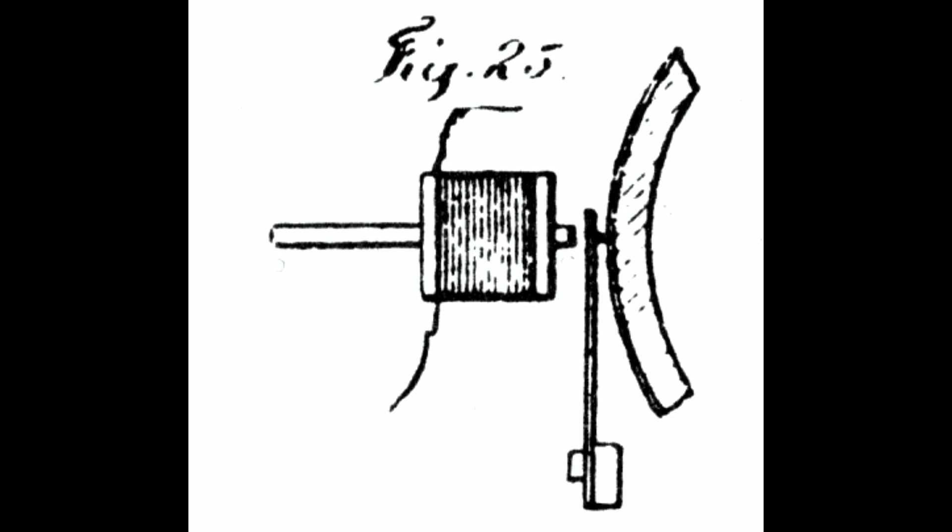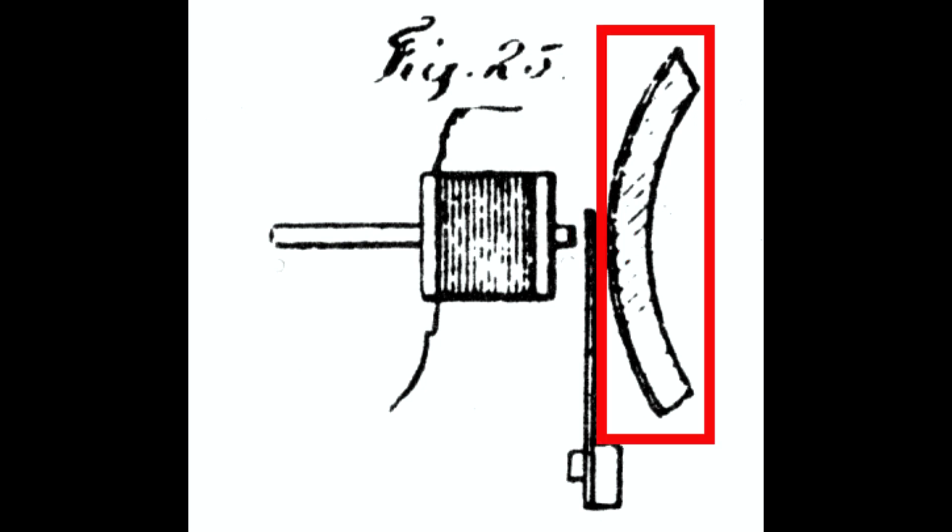Great Scott — what's this? It's a solenoid, an electromagnet: a coil of wire with a core, probably of soft iron, and then a stylus bar anchored at the bottom. The stylus bar extends upwards in between the solenoid, and there is a point which engages upon a cylinder. What we've actually got, in short, is a setup for electrical recording in 1877 — which is pretty sensational. We re-read the whole patent, and it also says we can record magnetically on a strip of metal — so he's got magnetic tape recording in there as well.